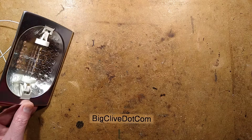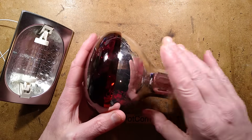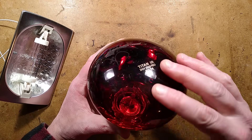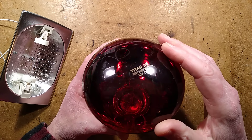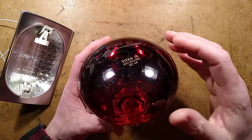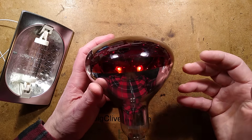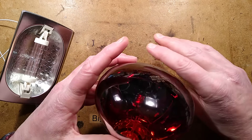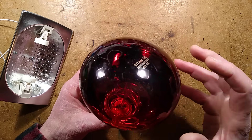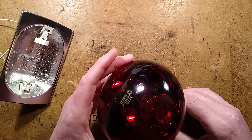There is another option — this one is broken with a wobbly end cap, but this is a traditional chicken coop type heat lamp as used on farms. You get the version with red glass and also the version with clear glass in the front that puts out a useful amount of light as well. This one is 250 watt, but you get complete fittings to suspend them from the ceiling, with a grill in front in case of glass breakage. They put out the same golden radiant warm heat — a very efficient way of workshop heating.